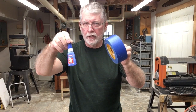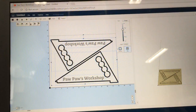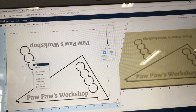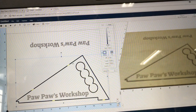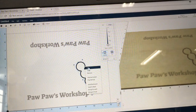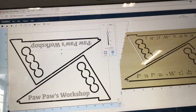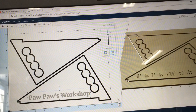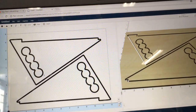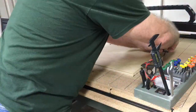Let's get started. I designed a couple of push sticks in Easel and I want to prepare them to be carved. First thing I did is I opened up the project in two different workpieces, then I removed the outline from the workpiece and left only the toolpath — by doing that I'll cut the toolpath first using a sixteenth of an inch bit. On the second workpiece I did the exact opposite: I removed the toolpath leaving only the outline, and this time I'll be using an eighth inch bit to make that carve.